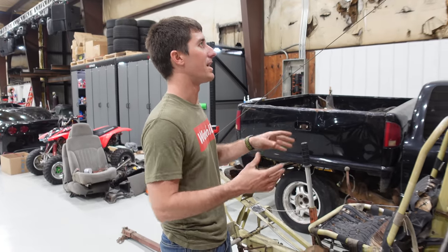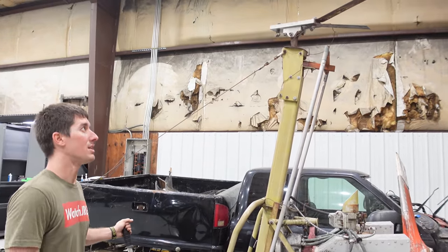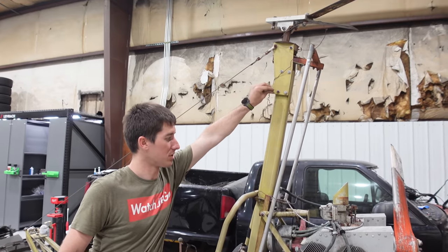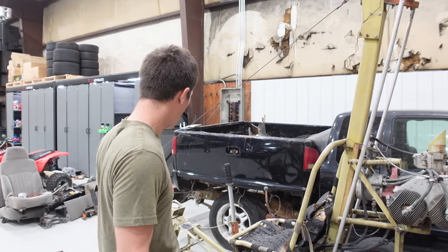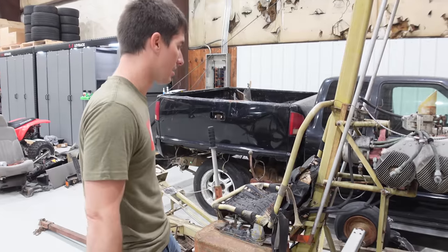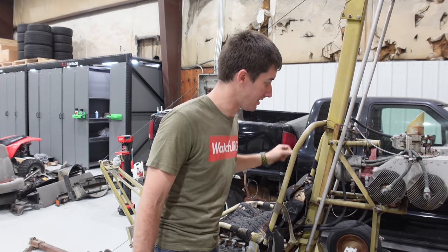There's no complex mechanism for that. And then this controls the swash plate — so we have our side-to-side tilt on the rotor, and here we have up and down. Probably literally translates to up and down. I just noticed there's an on/off switch, which appears to be the actual on/off switch for the engine. There's no power on this thing — it's not running a generator, it doesn't have any lights. Probably a magneto and some kind of vacuum pump running the fuel system.